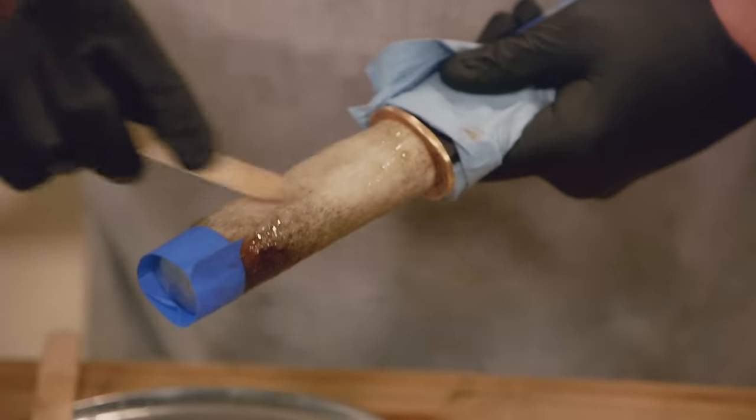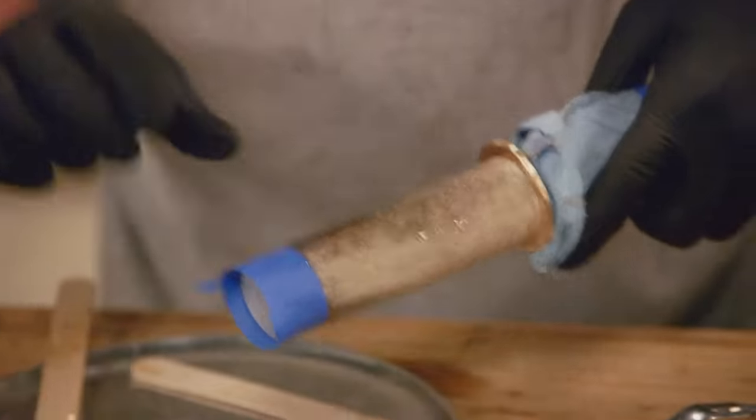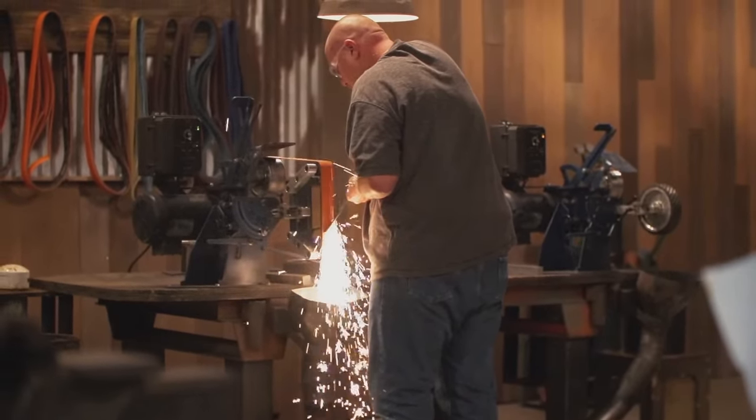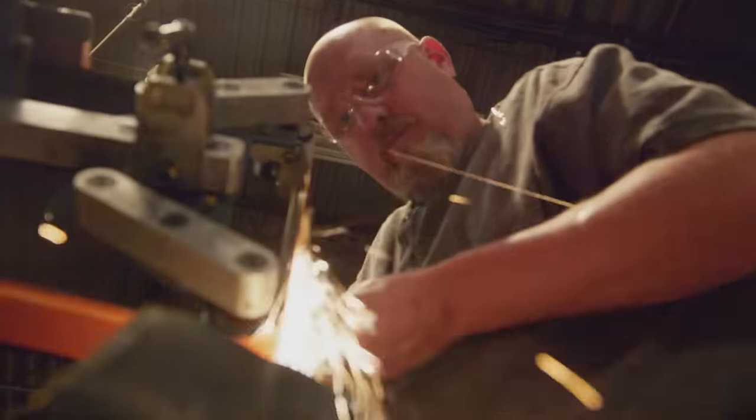Now, how thick of a coat do you put on this? In something like this, to get it a 16th of an inch in is pretty good. Yeah. Now, Mark had a pretty complete blade with an edge at the end of the first round, but he had a weird kick to his tang. As I'm grinding this tang, I just need to make sure that there's enough meat left in that tang and handle to where it makes for a strong knife.